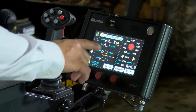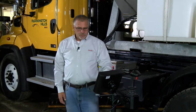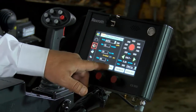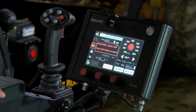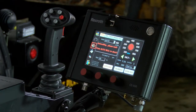First thing we need to confirm is that we're in auto mode, because our conveyor is equipped with an auger feedback sensor that gives us a hundred pulses per revolution. So the first thing we're going to do is an auto null. What we're looking for is our minimum and maximum operating window. We have an auto null button down here on the bottom. Once the truck is running and up to about a thousand RPM, you just press your auto null. It's going to tell you to wait a few seconds. It will ramp the auger up, find its high spot, then slow the auger down and find its low spot.